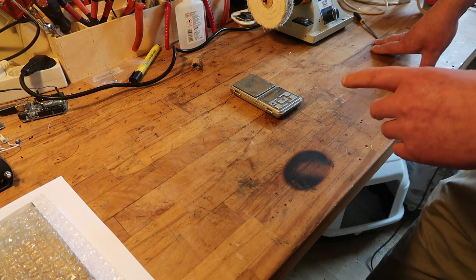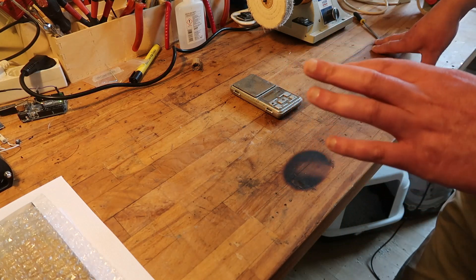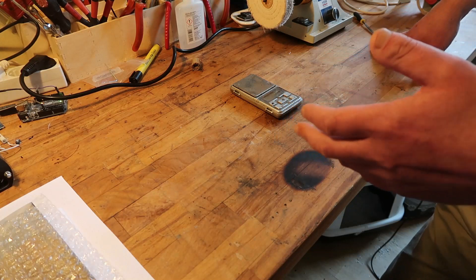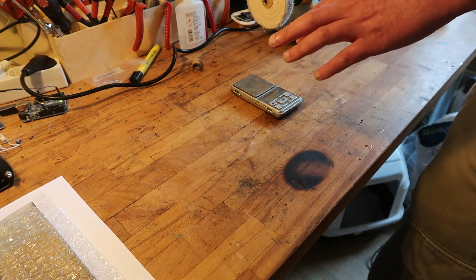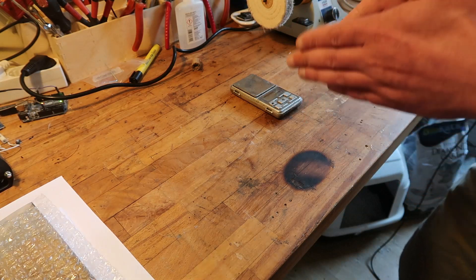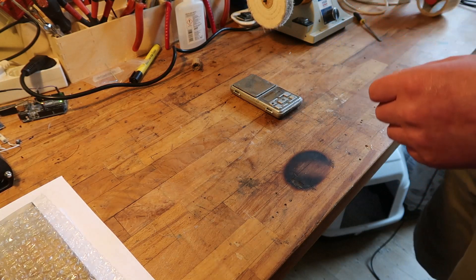The last one I tested might still be slightly shorted out. So instead of 3.3 ohms I was getting, this is 4-something, but I'll measure it. That has to do with maybe not shorting out anymore. And the traces became even a little bit smaller, because the trace clearance between the traces went up a little bit.